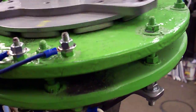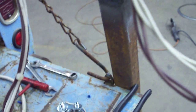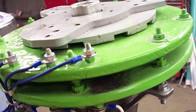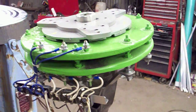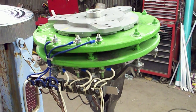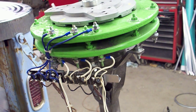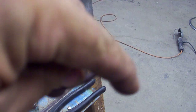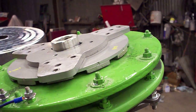I'm also able to lock up each stator individually. Look at this — if I turn it, you can see it puts on the brake when I close the two wires together. So when the charge comes up, or there's a big wind, I can actually lock up the wind turbine with a switch from the bottom just by shorting the two wires together, and that won't cause any harm.